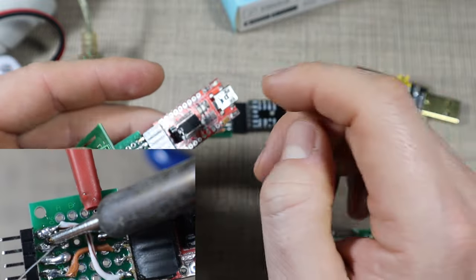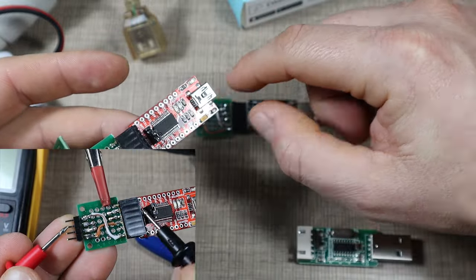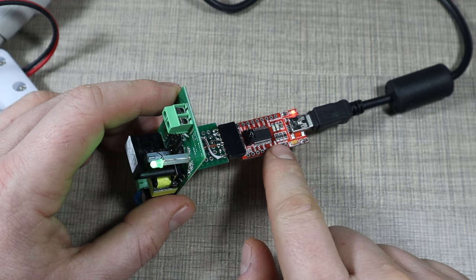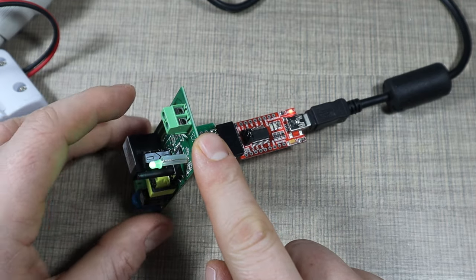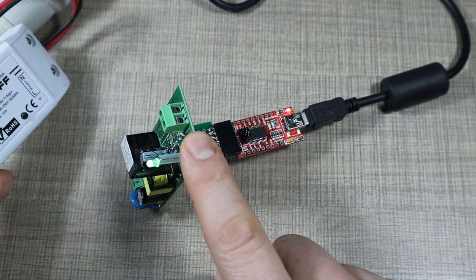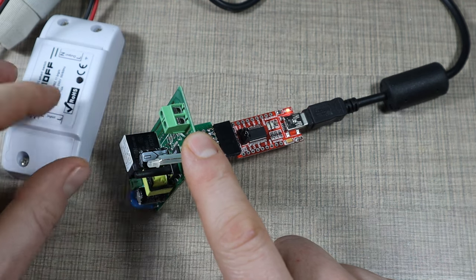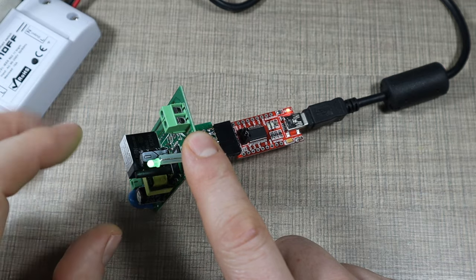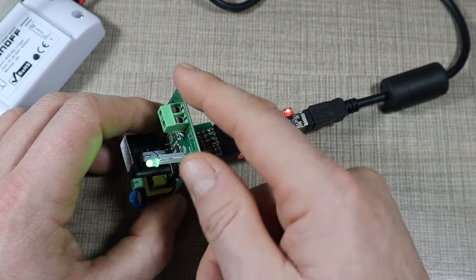I have a USB lead coming from my computer, so let me grab an adapter and connect the switch to it. Here we have it — it connects to the USB-to-serial and then powers on the Sonoff switch. It is really important to know that you should never have the Sonoff switch plugged into mains power when you are doing programming or accessing it through serial, because that might destroy both the switch and your computer if you're not careful. Always only connect to the switch via serial, powering it from the computer.